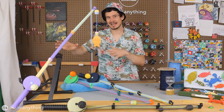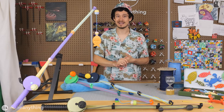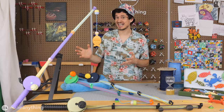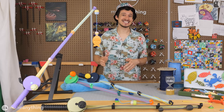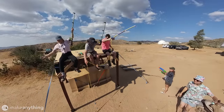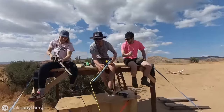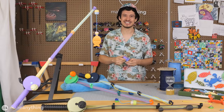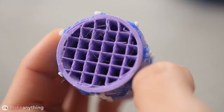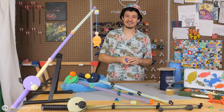There was also this pastel rod, which was printed entirely with Polyterra's matte PLA, which looks fantastic, but its layer adhesion is a bit weaker than your standard PLA filament. So the grip did end up snapping in half a few times during some especially chaotic fishing. So one solution would just be to print it with more perimeters or higher infill,